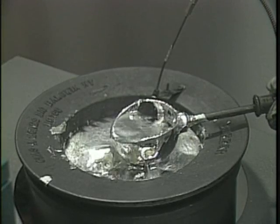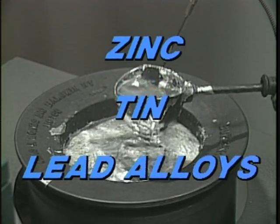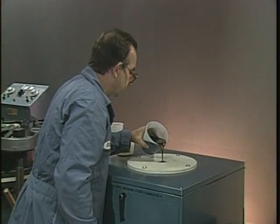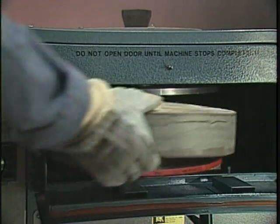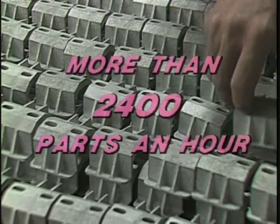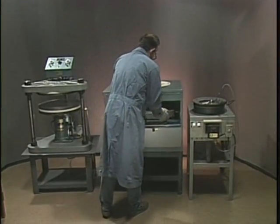Parts can be made from commercially available zinc as well as tin and lead based alloys and, to a very limited extent, aluminum. Parts can also be made from quick setting thermoset liquid plastics such as high strength polyurethanes, polyesters, and epoxies. The tough, high heat and chemical resistant Texel molds can last 300 to 400 cycles or more. Molds can be continuously cycled 50 to 60 times an hour, allowing the system to produce more than 2,400 parts an hour. Changes in design simply require the creation of a new mold instead of costly retooling, and can be implemented quickly and inexpensively.